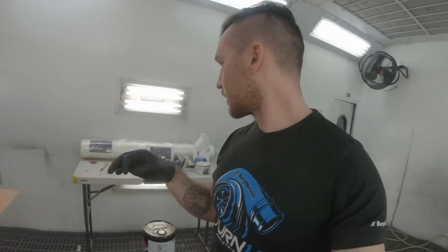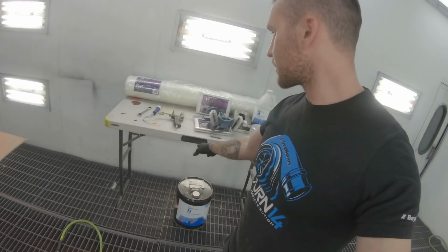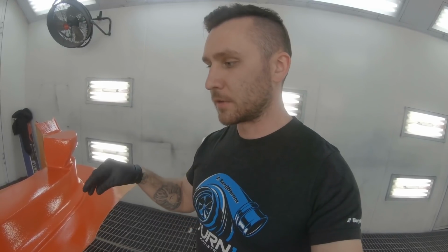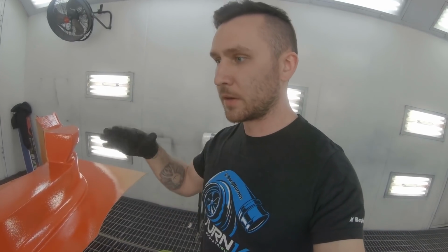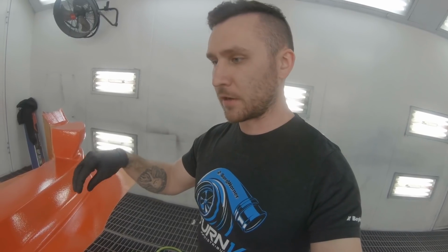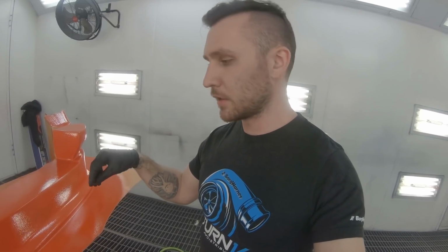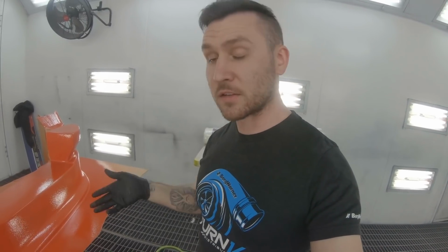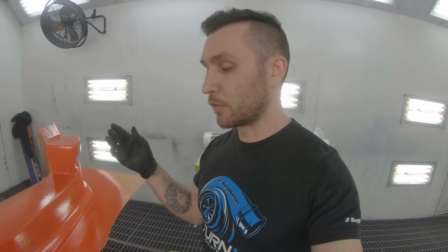just like almost everything that uses MEKP hardener, where it's thicker, it actually heats up faster, and that'll basically warp, and it can dry at different rates, and it can start doing these weird vein-looking cracking things underneath, and then it'll give you a bunch of voids in the bottom of your mold, which you then have to go fix, or if they warp too much, you might have to just scrap that whole mold and redo the whole thing again.